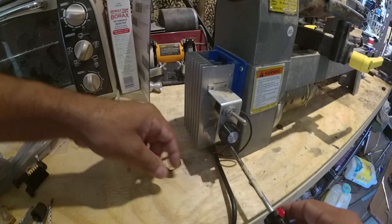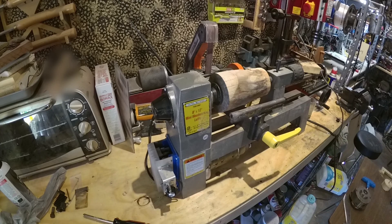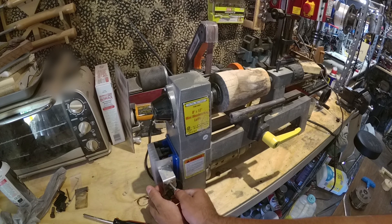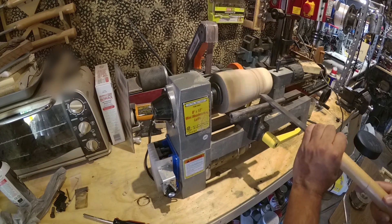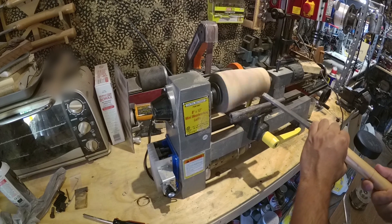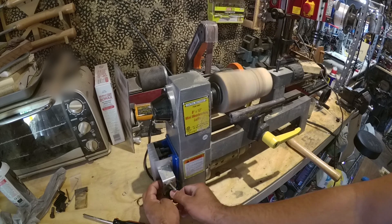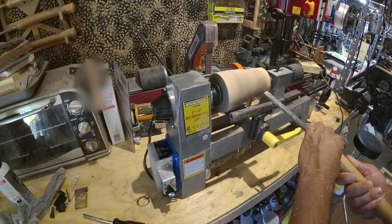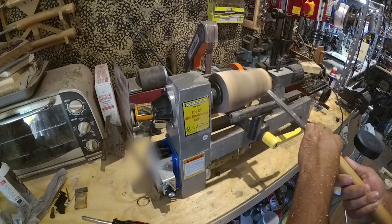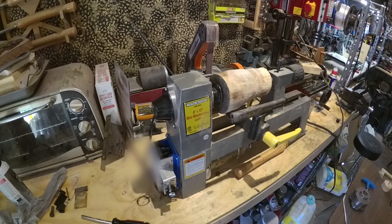There's the speed control, and then on and off. That on/off is controlled at the 110-volt AC line, so it turns the whole thing off and not just the DC power. It works surprisingly well — it's way more powerful than the other motor. And if it catches a snag, it will stop real quick. You can definitely cut into wood quicker. And that's it — that was the upgrade. Thanks for watching.